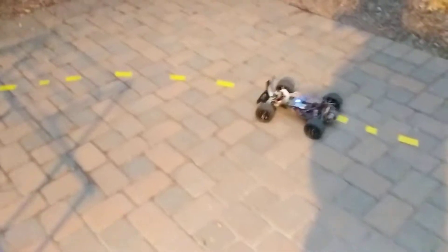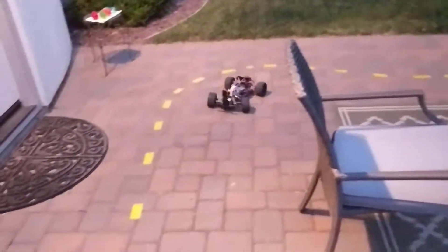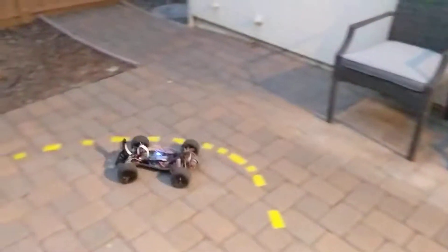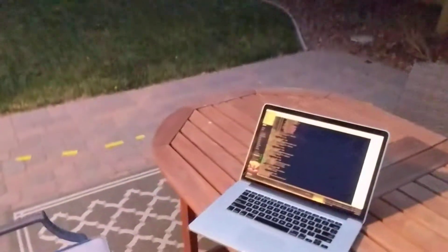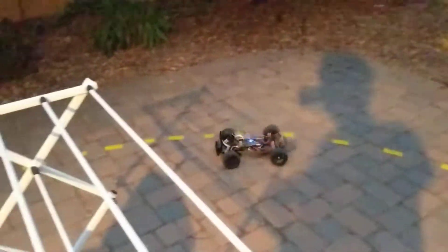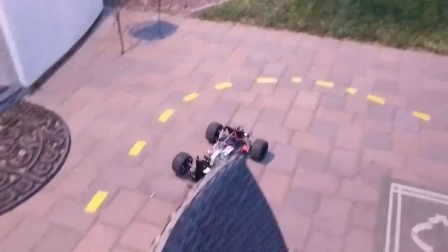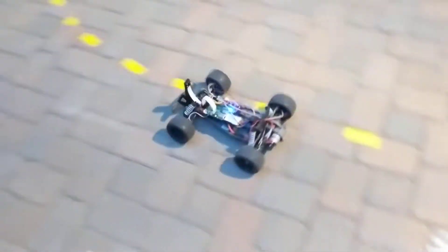I should explain how the camera input works. What it's actually doing is looking at the ground in front of it, reprojecting it to a flat plane, and then binning every pixel to 25-millimeter fat pixels. I do that because the lines are exactly 50 millimeters wide, so having two buckets per line lets me find the position within a pair of pixels where that line is. Then I do a convolution — it's called a top hat filter in some of the literature I read. It's a hand-tuned convolutional filter that looks for lines of a certain width.